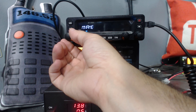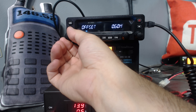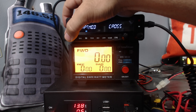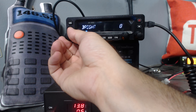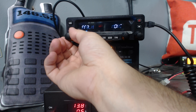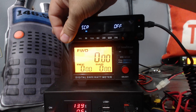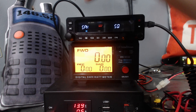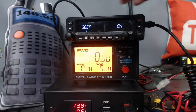Busy shift is off. Timeout timer. Memory name. Now we're up to the 200s and 300s — offset, set to 0.6 for the 2 meter offset. ARO. Now in the 400s — repeater mod is crossband, so we're in crossband repeat mode. ATX and BTX. Repeater hold. It jumps to 500. The numbers are not in sequence order — they skip around a lot. It's also got two-tone and five-tone. Speaker, screen, SCR, VOX, password.